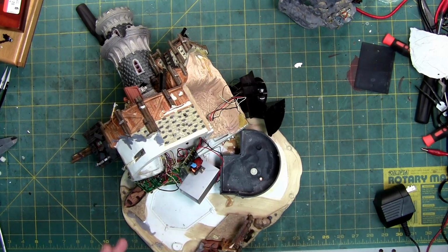The micro switches are glued in place, so when you break them free, try to glue them back where you found them. I would recommend a hard glue, super glue, Gorilla glue, whatever you prefer. Not hot glue. You don't want the micro switches to move, because then they don't do their job, which causes the motor to try to rotate in a direction it can no longer rotate in, which can burn up the motor, circuit board, or break the gearbox.